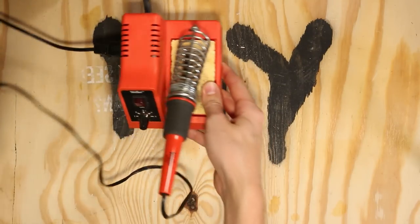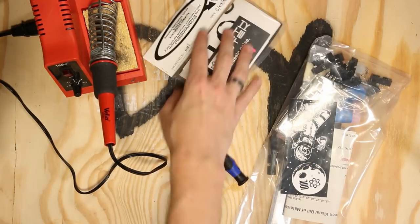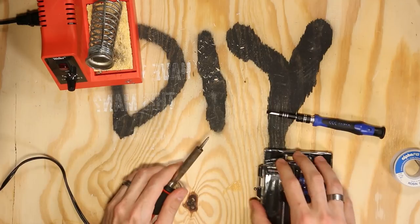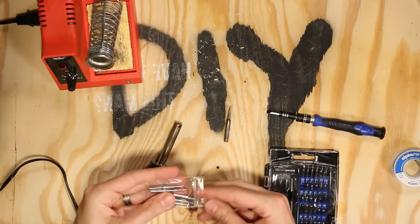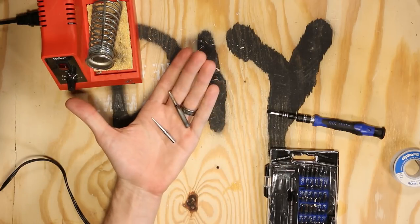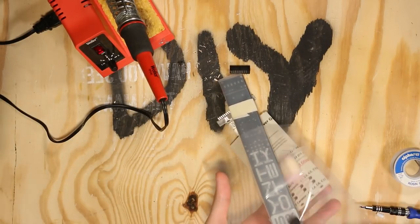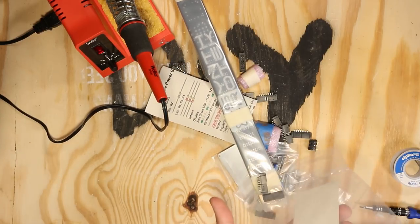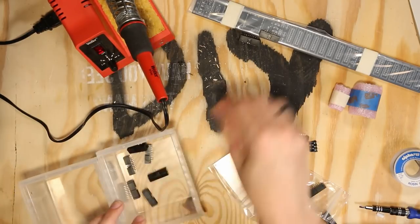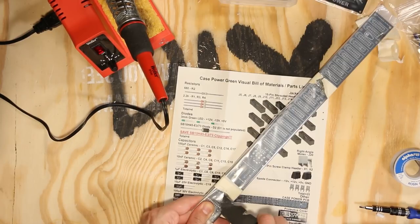This episode you're gonna need a soldering iron, some solder, the same screwdriver from last time, and a Synthrotech kit. All of these products are linked in the description below. I decided to change my soldering iron tip — my old one was a spade but these new pointy ones can get at really fine, hard-to-reach places, which this board has plenty of. I also sorted all the jack connectors into one bin and everything else in another. The bill of materials is super easy to follow and the pictures are very easy to read.